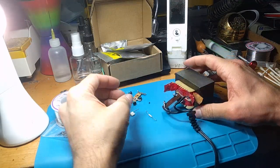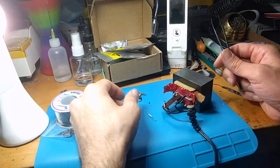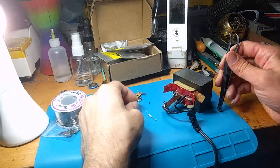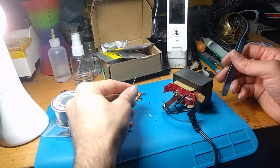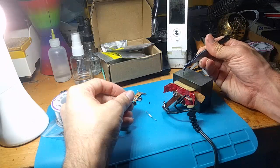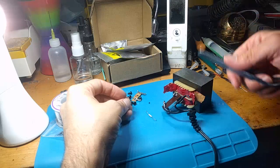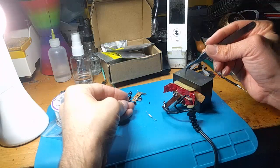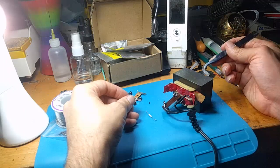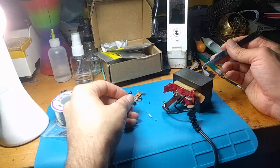Lucky for me, I was watching some videos on YouTube for how to repair transformers because I realized this thing is so specialized, I need to just try to repair it. There's a really cool video that I'll try to link called Making Stuff with David or something like that, where this guy actually removes all of the plates here and uncoils the wire to find a thermal fuse inside the transformer between the primary and secondary stage. Primary stage, by the way, is the AC voltage. The secondary, so they're both AC, but the primary is the line voltage and the AC is after it's converted.